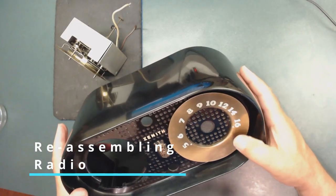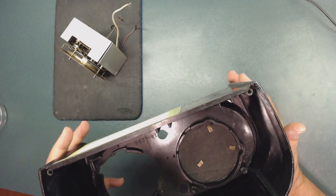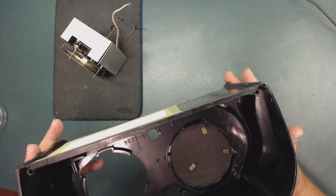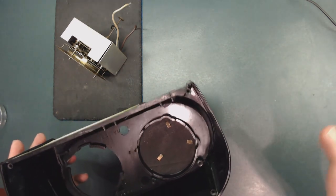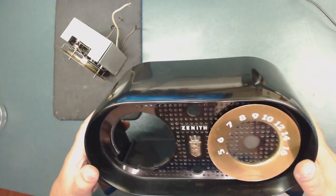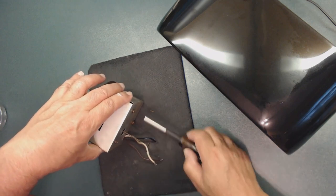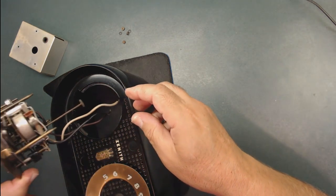The chassis is already installed. In the back I found a thin fabric — the kind that usually goes under a couch — that's exactly like the original design. I cut pieces, used spray glue, and installed it. That looks nice. Now let's put the clock in. One thing I forgot: don't put the cover on first — the cover goes on after everything is installed. The radio goes in this way; see the little cut, the spring goes right there.